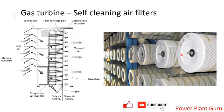There will be multiple rows of this kind of filter. Once dust is deposited on the filter outer surface, the delta P — the pressure difference between the clean side and the dirty side — will increase, and it will also cause aging of the filter. To remove the loose dust, on the right-hand side of the filters, which you can't see in this image, there will be a pulsation system.